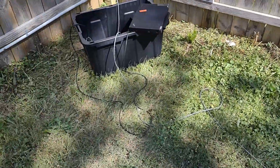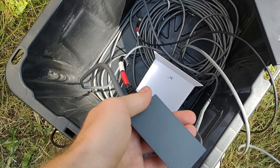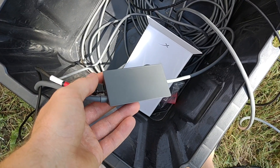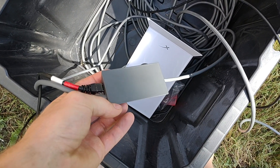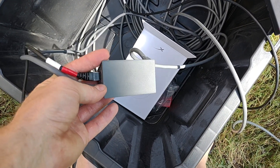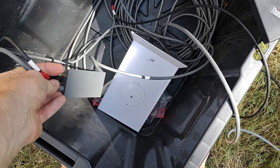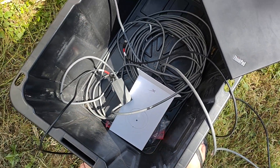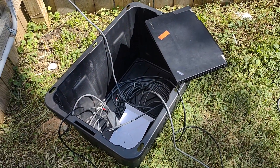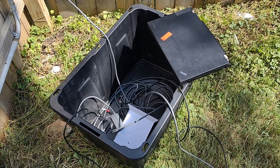What I ended up doing was unplugging the Ethernet adapter for the Starlink — this is the SpaceX adapter needed to get an Ethernet jack on the second generation dish. Unplugging that and then plugging the dish directly into their router box and leaving it for a minute, the system actually started to come back to life and I was able to control the dish and have it come out of stow mode.